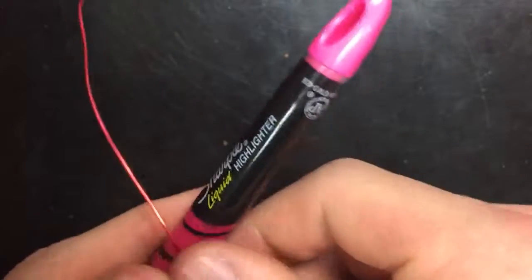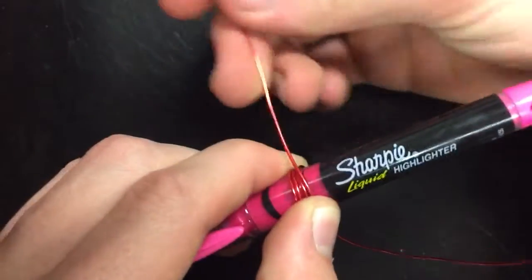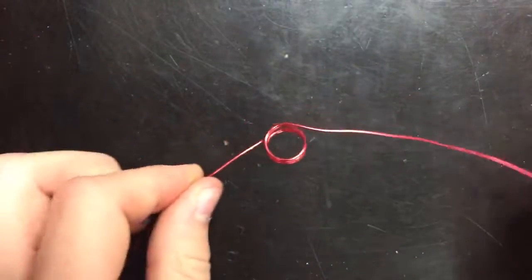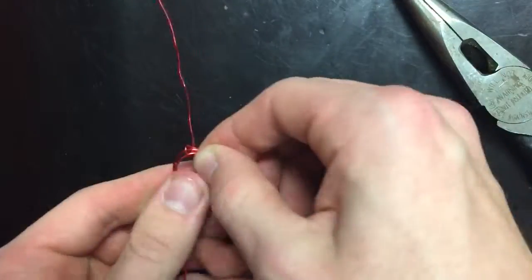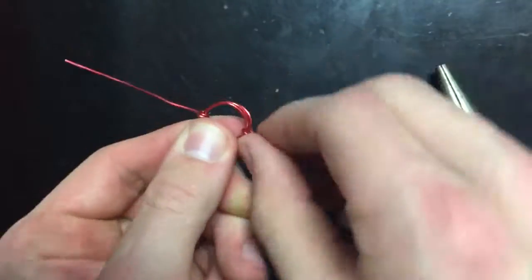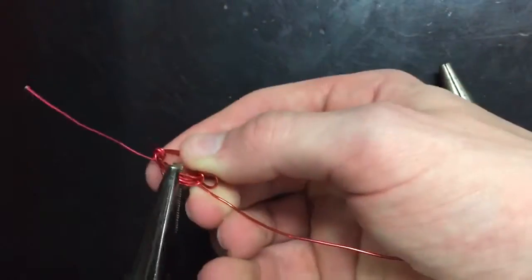To start off, you're going to want to make coils out of your wire. This is how the motor works — by sending a current through the coils that creates an electric charge in a circular motion, and having a perpendicular magnetic force causes it to spin, resulting in the rotation of the motor. To secure the coils and make them tight, we're going to take the excess wire at each end of the loop and wrap it around the coil. Doing this pinches the coils of wire together and makes sure that they will not come apart when the motor is rotating at very high speeds.